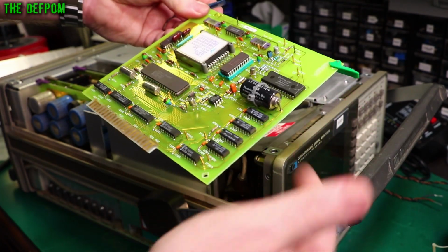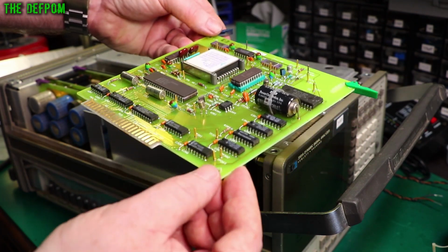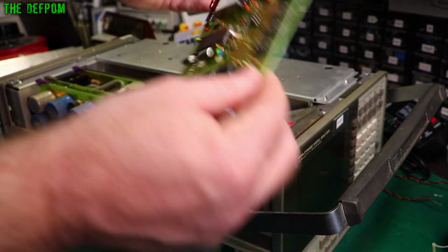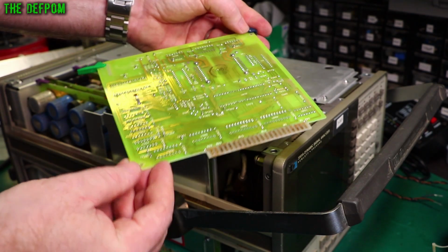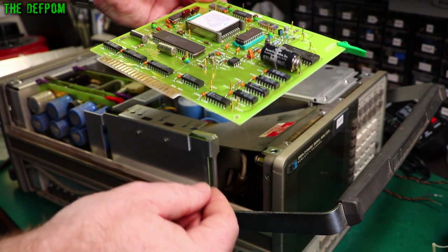Anyway, let's have a close look. We'll be careful about not putting the probe down, shorting it in the battery, in case it's still okay. The switches look fine. The connector is oxidised, like the other ones are. Back of the board, never been touched, and it's factory. So let's check this battery, it's bound to be flat, isn't it?